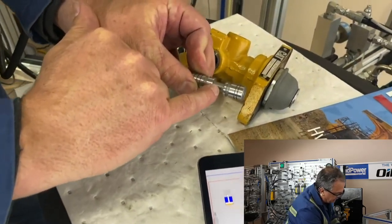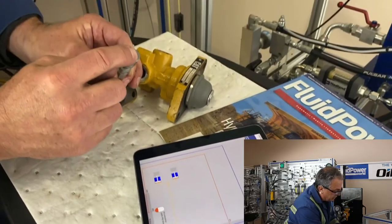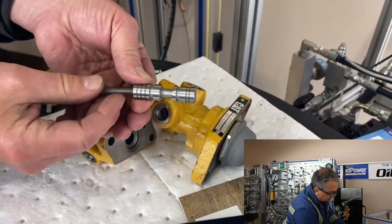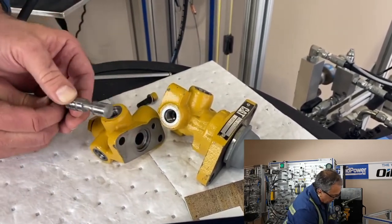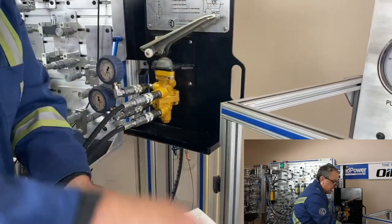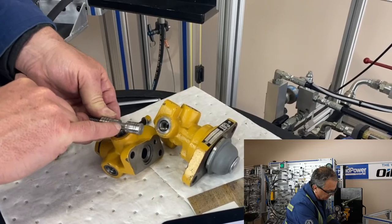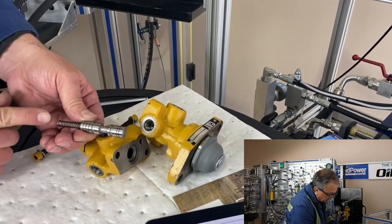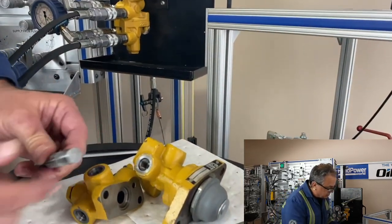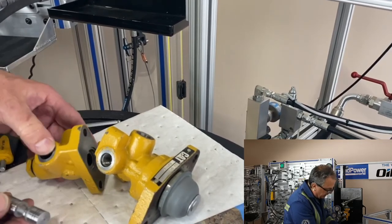How is that done? Do you see that tiny little hole? That's small — it doesn't take much contamination to plug that thing. That's not available at the top, but it does pass through to the bottom to the spring chamber, and that outlet pressure now acts on all the surface area at the bottom and inside, and a bias from the spring as well to push closed again — until the operator decides to put a little bit more pedal force, tensions the top springs, which makes the spool dip down and grab a little more pressure, then close up again with that balance. Clearly the machining has to be laid out very cleverly and carefully, but that's it in essence.